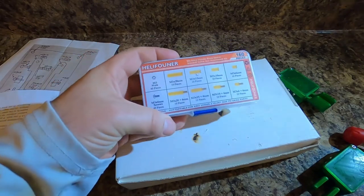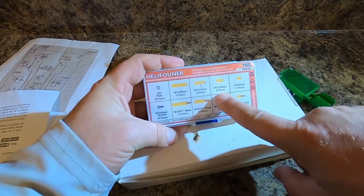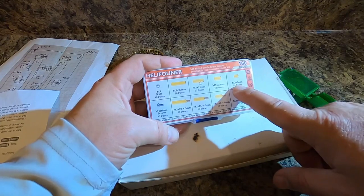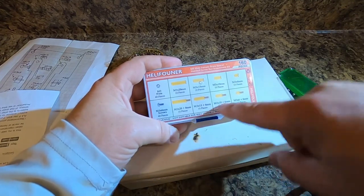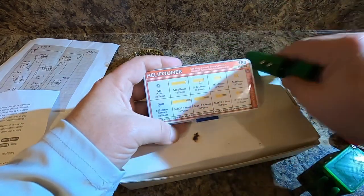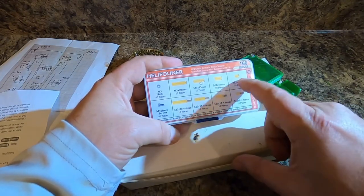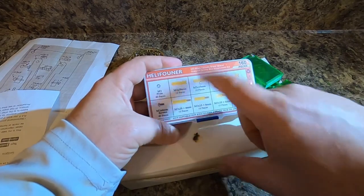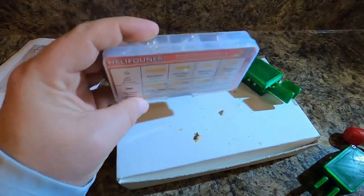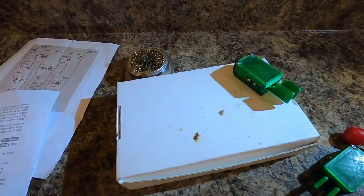These guys right here, these are your standoffs. I use the M3 by 10 millimeter. On the drawing that was made by Mr. Kane, he used the 3x6. If you drilled the hole out on the bottom or cleaned that up, you could have put a nut down there. And you could also have used the M3x10 or the M3x6. Well, there's 20 there each. You could make a bunch off of that. And everybody who does projects needs some standoffs anyways. This was, again, about $10. So you can see, if you nickel and dime it, it adds up quite a bit.